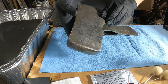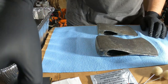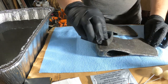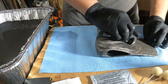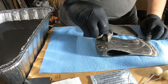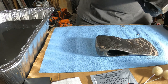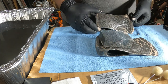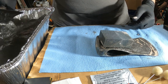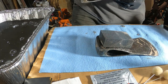And so at this point, I'm just going to go ahead and do the degreaser again per the instructions, and then try bluing it. I don't think there's any benefit. I haven't noticed a change in continuing the rust remover. So now that I've got this one completely degreased, I'm going to stick it in the water, rinse it off, take a new rag and dry it.